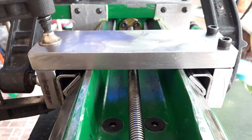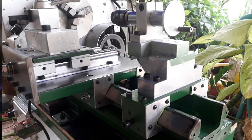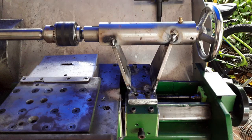Next on the agenda was to mount the tailstock, and it got the same treatment as the main carriage. I have to admit I didn't take the time to lap the bits of angle iron like I did with the carriage, and consequently it's not good — I need to revisit that. After running for a while, the pissy little tailstock with its lack of reach and three-eighth chuck was getting to me, so I ordered a new 2 Morse taper tailstock through Lazada — and the damn thing showed up as a 3 Morse taper, so I had to send it back.